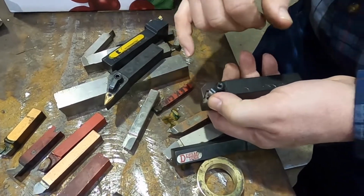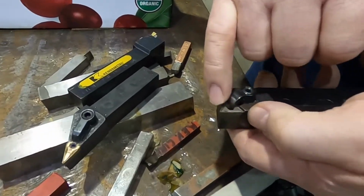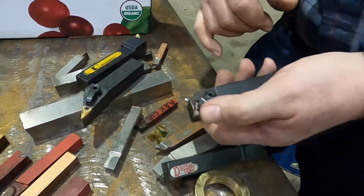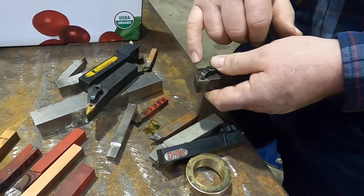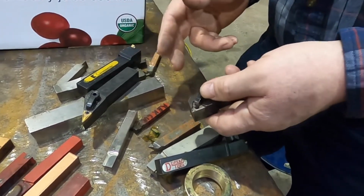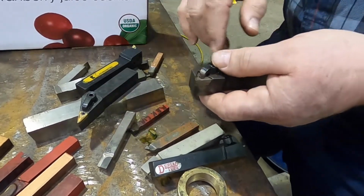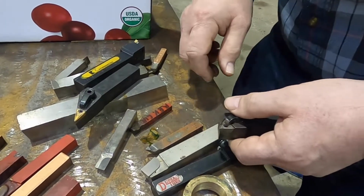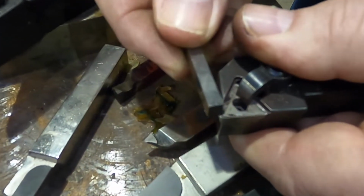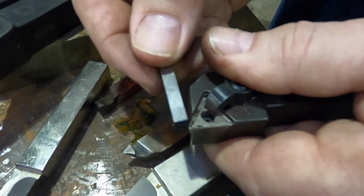But while they're all the same, the chip breaker will vary from brand to brand. Right. So the chip breaker might work real good for you on one particular TN, and this is a P actually. This is not a TNMG here. I was just pointing to the chip breaker because it's on this one. But you could have that specifically. You love the way it's working. Everything's just perfect on this brand. You change to another brand, and you'll never get the chip to break. It won't work, or it will go to chattering terrible because, like you can see on this one here, they're just not always the same. This chip breaker starts back a little ways. That chip breaker is not clear out to the front. So at the very front of this, you have just a clear cutting.